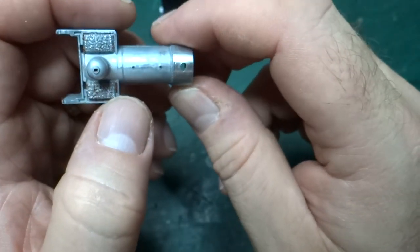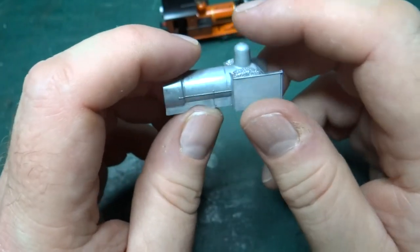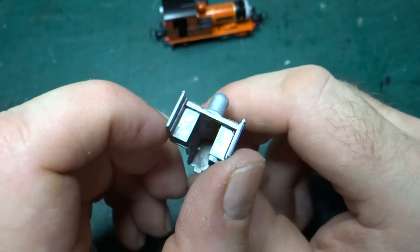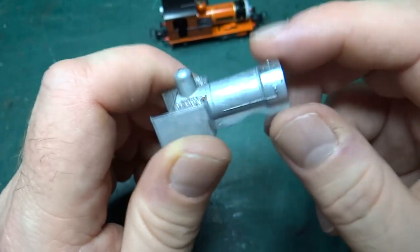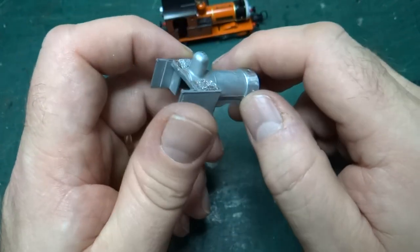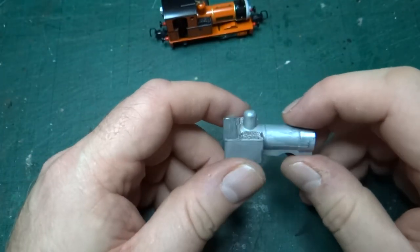That's the next job. I can't attach the chimney or do any other detailing until I've got this chunk off. It's moved on quite nicely — the Dettol paint stripper works really, really well on metal castings. You can't use it so much on plastic as it tends to make the plastic a bit soft, which is why I haven't done the footplate or the cylinders yet. But for these castings it leaves a really nice finish. So that's where we're at for now.